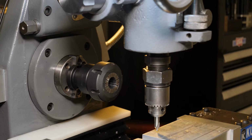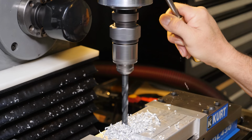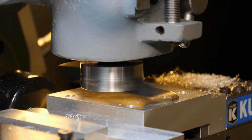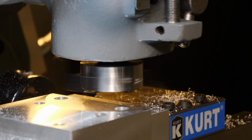In the past, I always removed the tooling and the holder from the horizontal spindle if I was using the vertical spindle because it was an interference problem with the vise. Don't really seem to be having that issue now, although there probably are some instances where it could be an interference. But now I'm able to just remove the tooling and leave the holder in place. I found a cap plug to go over it to keep the chips out while I'm using the vertical, and it seems to be working great so far.